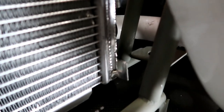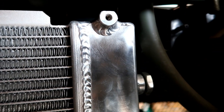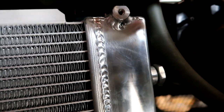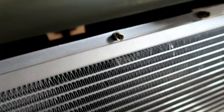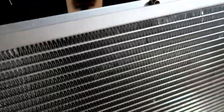I got the tubing to do it there. And then up here, it looks like this little guy gets bolted to something to hold it in place, which I could also make a removable part for, easier that I can hook up and bolt. Now this is the problem I'm having: the rivnuts that come with it for the fan shroud are on the other side. I'm gonna have a fan that is a puller, not a pusher, so I'm gonna have to add new rivnuts on this face.